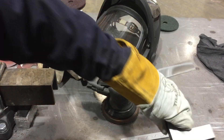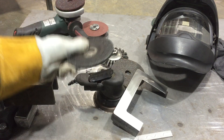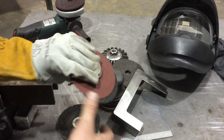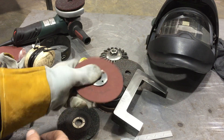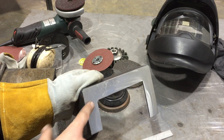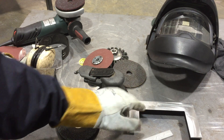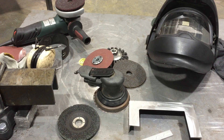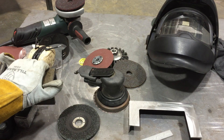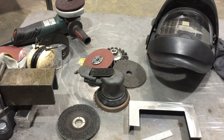Good luck with that. In the Tyler Shop you'll find a whole plethora of quarter-inch grinding wheels and some sanding pads — they wear out fairly quickly, so while supplies last, or it might be a resale or purchase item. The main thing to know is that if you want things to look smooth all the time, it'll cost you money in abrasives and time. But it'll cost a lot less in abrasives if you take the time to lay in a good weld first. Always wear your safety gear: face shield, guard on the angle grinder, handle on the angle grinder. Always make sure your parts are clamped in a vise or on a secure surface, and you'll wind up with better results all around.